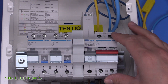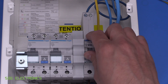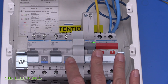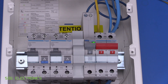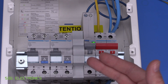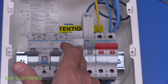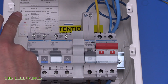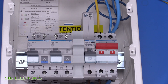It will be plugged into an isolation transformer, and we're not going to be drawing any loads so the wires are a little bit thinner than they would normally be. We power the unit up and get a green light, which means the AFDD is on and that's it — it doesn't do anything by itself. Interestingly, on the power meter this is actually drawing half a watt, so if you've got a whole bank of these you're actually going to be consuming quite a bit of power. If you press the test button, a moment later it trips off, and if you hold down the test button while it's off it tells you the reason why it's tripped — blinking red and green means the AFDD was manually tripped.